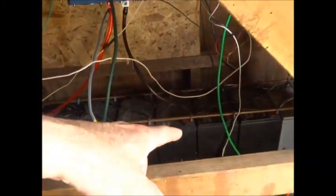And the other thing is not to have so many batteries. What if you just had like two batteries and then used grid tied on all your panels that are mounted, whether on the roof, but preferably a ground rack system? Try to avoid putting them on your roof. If you have lots of space around your house, build a ground mount system. Believe me, it will be much easier for you when it snows, and when something goes wrong on one of the panels or they need cleaning.